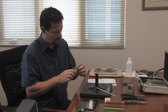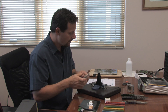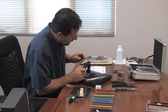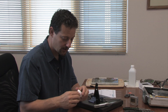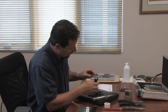So without further ado, we'll go ahead and get to clamping this thing and the challenges that a fully flat ground blade present. I've got a little trick here that I learned. On the inside of my clamp, I just put a little bit of double-sided foam tape — just the really cheap stuff you pick up at the grocery store for hanging posters and things. It's just a double-sided sticky foam tape, and I cut off two little squares and stick them on the inside of my vise.